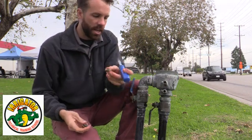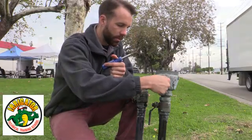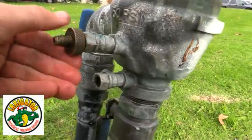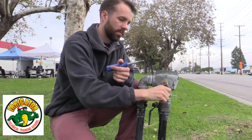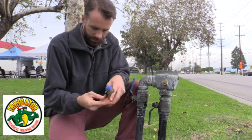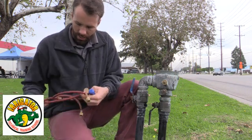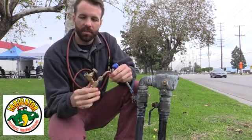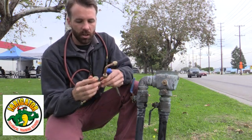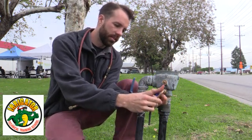Now it's time to put on my appropriate fittings. These fittings take the test cocks and give me a nipple where I can connect my gauge to it. Equipment I'm going to need: my differential pressure gauge, my high side hose which is my red hose, and my bleed valve arrangement. The bleed valve arrangement compensates for a leaky number one shutoff valve. I go ahead and connect that to the number one test cock.